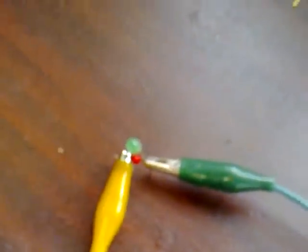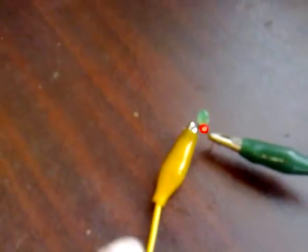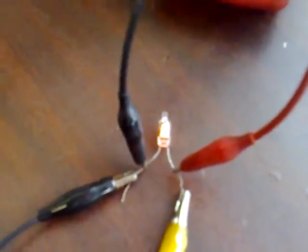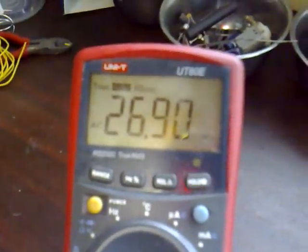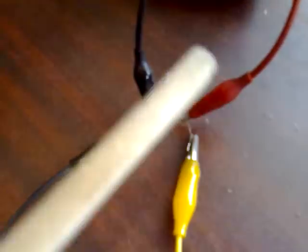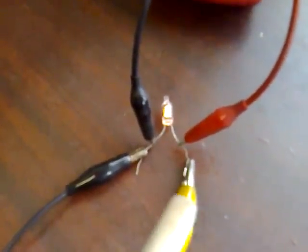After turning the power up a bit, the red LED came on but the green one hasn't, so current is flowing in one direction but not the other. The neon bulb confirms this — only one side is lit. We are seeing AC voltage across it, but the AC pulse is high enough in the positive direction to light the neon but not in the negative direction, so we're effectively getting pulsed DC.